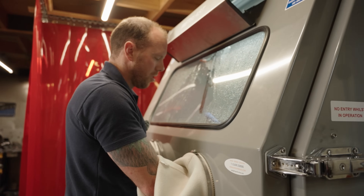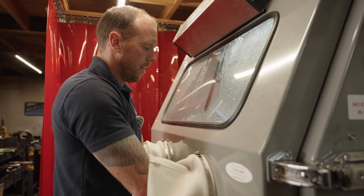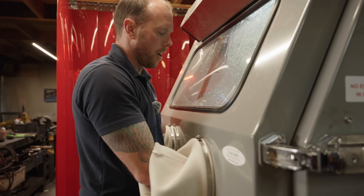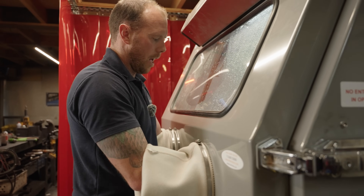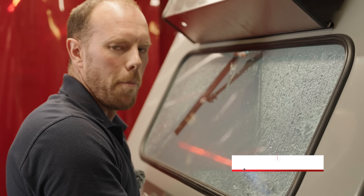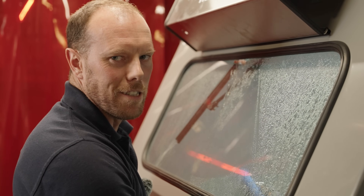It won't remove heavy crusty rust without changing the media. We've currently got a soft media in because we want to polish aluminium — a lot of our stuff is dated, maybe four or five, sometimes 20 years old, and we just want to bring it up and make it a lot happier. I want components we've installed to look great, especially on restoration projects. Look at that in there — it's been zinc coated and passivated at some point in its life, and the machine brings it back without harming that coating. It's quite therapeutic as well.